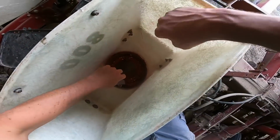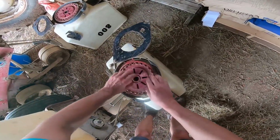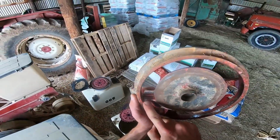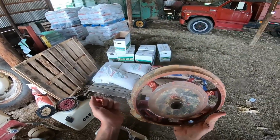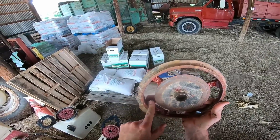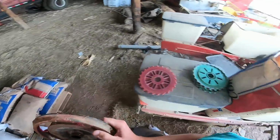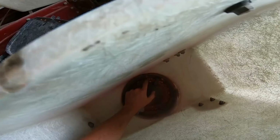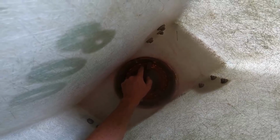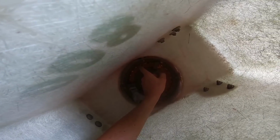There's 2 bars that stick down right there, which I guess I could grab from one of these upside down units. So right here, these 2 things, these are called seed knockers. And maybe that's the stripper and that's the knocker. That knocks it out of the hole if it's tight. And these 2 little bars right here run along the plate, knocking any extra seed that's trying to double up out of the hole. So like right there, it looks like there's 2, but that seed is above the plane of the plate, and when those bars come by, it'll get pushed out of the way.